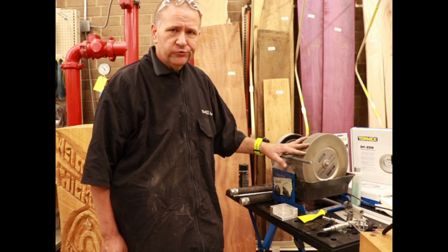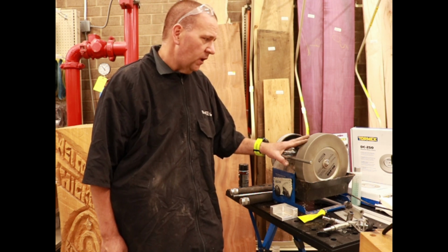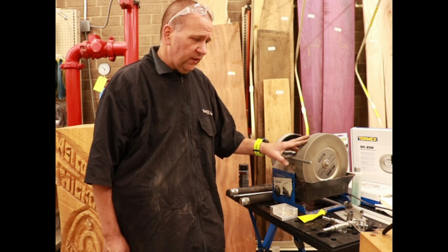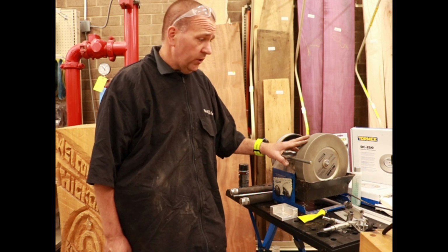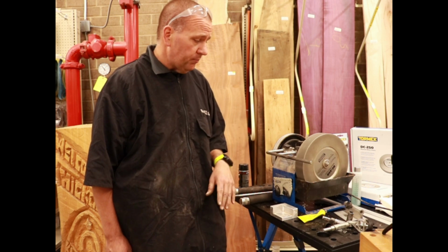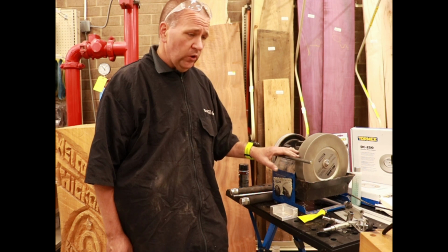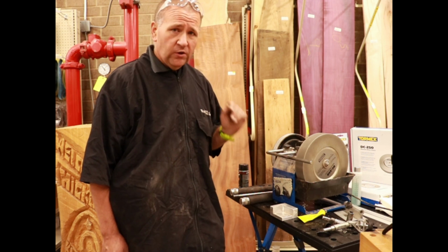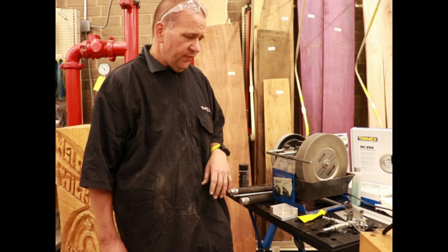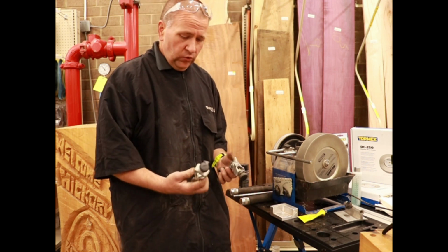But if you want to do other finer things like planer blades and everything else, you may want to go to the fine diamond wheel. The standard wheels will work as well for any of your turning needs, but this one has one advantage. Once you set your bar, if you're mainly doing bowl gouges, you never have to move it, because you'll never wear your wheel down. It's always consistent. Just go back for a light touch up and you're done. It's very quick.